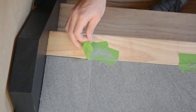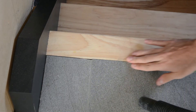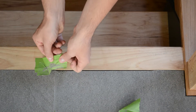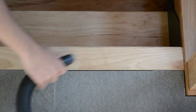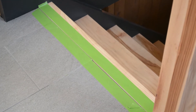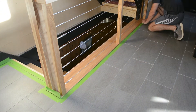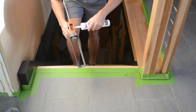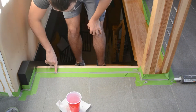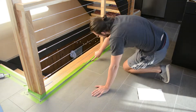I first had to remove the tape I had placed to prevent grout from going into this joint. Once the area was clean, I came back and outlined all the joints with some tape. Here I'm using frog tape — this is a very high quality tape and I definitely recommend it as it will prevent the silicone from bleeding into other areas you don't want it to. Once the tape is complete, you can come back and start caulking. You don't need to be too careful with this as we did a lot of prep work with that tape, so there can't really be much to go wrong. You can just spread it with your finger — it can be a little bit messy, but similar to the grout you want to make sure it fully fills the joint, so use your finger to push it down and make sure you get all of the silicone into the joint.